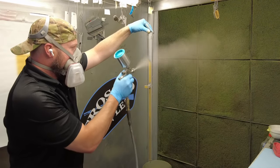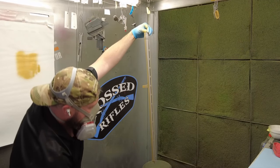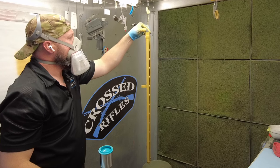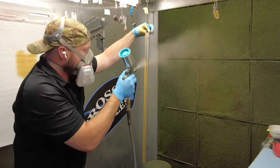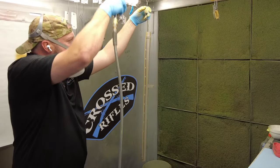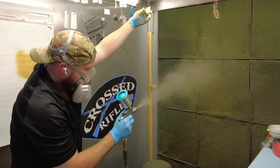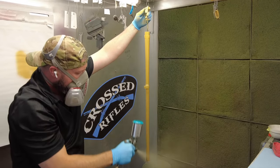We do the same thing on the barrel. This is a tall barrel so, especially with my shoulders, I start to really point the gun straight as I get upward. The goal is to spray through the piece all the way up to the top — start before you spray, and same thing going back down, start your spray and move all the way through the bottom. Very important to get a good equal coating all the way through. We're not hurrying — laying out a good wet coat of Cerakote, nice and even all the way through.